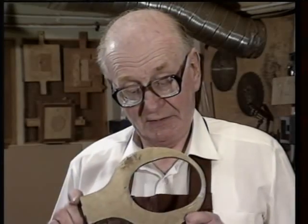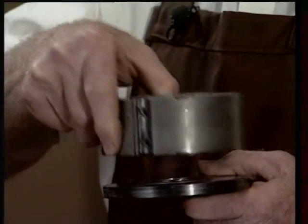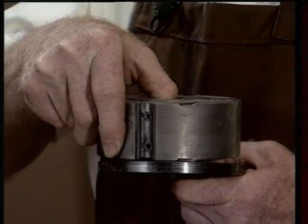There are two main ways of carrying out shape work on the spindle moulder, using the ball-bearing follower or the ring fence. And I will show you examples of both methods. Now, the combination of the ball-bearing follower and a matching rebate block is excellent for cleaning up shapes prior to moulding, and this is the way to tackle the job.